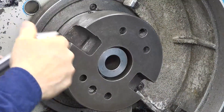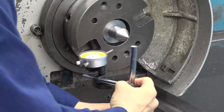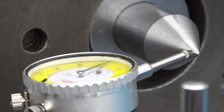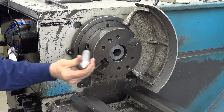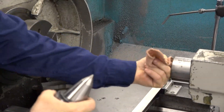Then clean the inside of the headstock sleeve and the live center. To verify this has been cleaned correctly, mount an indicator with the indicator needle against the point of the live center and check for runout. If the center runs out more than the allowable part tolerance, take the setup apart and re-clean all of the mating surfaces. Finally, you'll need to clean the tailstock spindle and the tailstock.